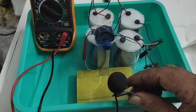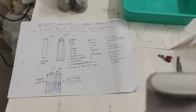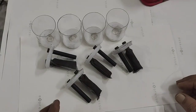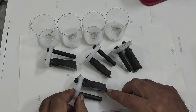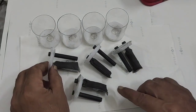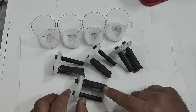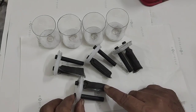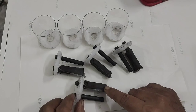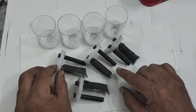This is called a super-capacitor. It is still running. To prepare this super-capacitor, I have taken 8 carbon rods. Each carbon rod for a 1-1 section, and one carbon rod I am filling with the metal oxide — mostly carbon plus graphite plus manganese dioxide, then traces of lead and cobalt. Similarly, I have done for the other sections.